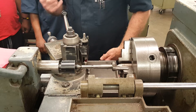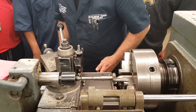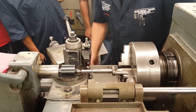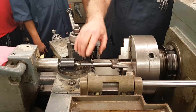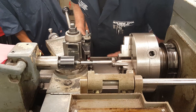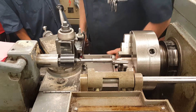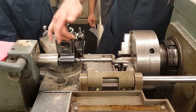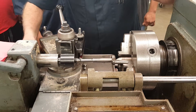Now what I want to check is my travel. I can go back without hitting the tailstock, so I've got plenty of travel that way and plenty of travel the other way. I'm going to go right into my groove that I made — that's where I'll stop. I'll bring it in a little bit closer and make sure I can get almost right up to the tip of that live center without the side of this hitting the live center. Now I can lock this down.